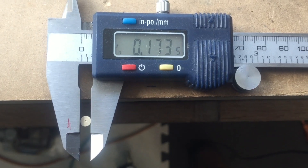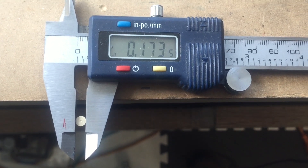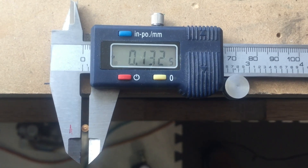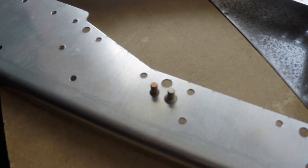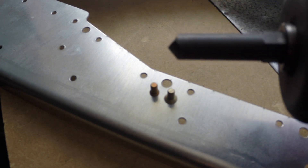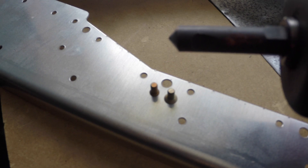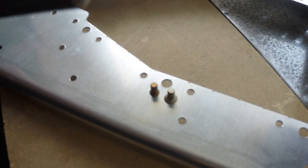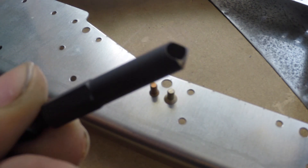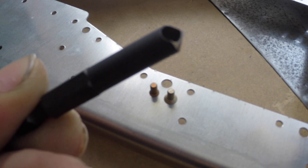This is what they look like from the top side — standard versus the NAS 1097. Some people use a countersink tool, something like this. This is my zero-flute in a cordless screwdriver, and this definitely produces the best finish while deburring holes and slightly countersinking.